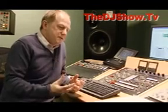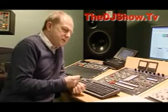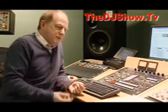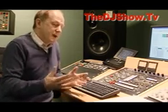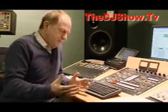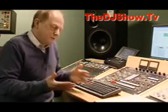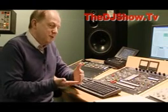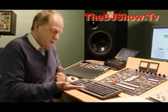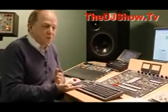45 is better technically in the same way as on a reel-to-reel tape machine. The faster the tape speed, the better the quality. So by choice, you'll try and get something cut at 45. But because the turntable's going faster, and you're cutting the groove, you get to the middle sooner than you do at 33. So the track we're doing today is 6.5 minutes, so that's no problem. I know that we can do that at 45.